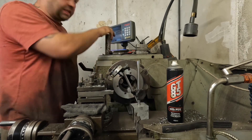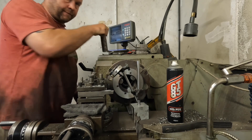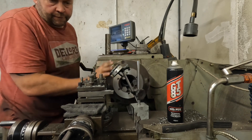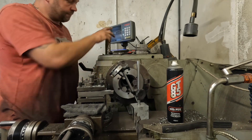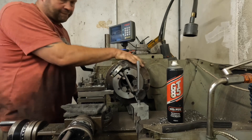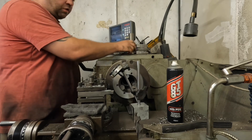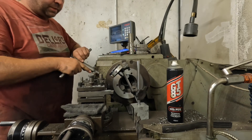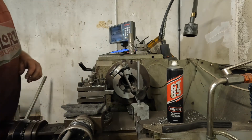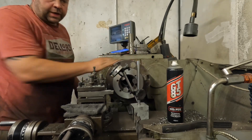I've got it down to three thousandths of an inch now, so I'll just try and get it down that last little bit. There we are — absolutely bang on, no run-out in that at all now. Just give it a quick nip up in the lathe, spin it again just to make sure. Yep, perfect.